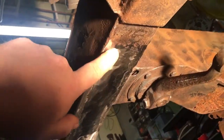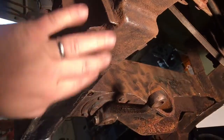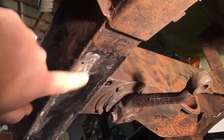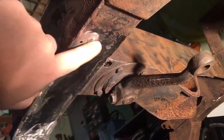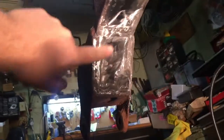While I was welding back here, I blew a big huge hole right here because the metal was too thin. I second-guessed myself — I should have actually taken it all the way back to where the bump stop for the axle is and welded right across the bottom. But the metal right here is pretty good so I didn't want to go too much further. The metal over here was too thin, so I did another patch here — just a little piece — and welded it together.